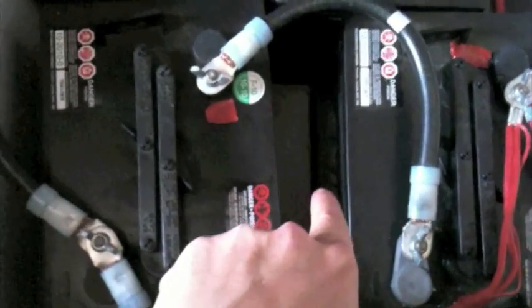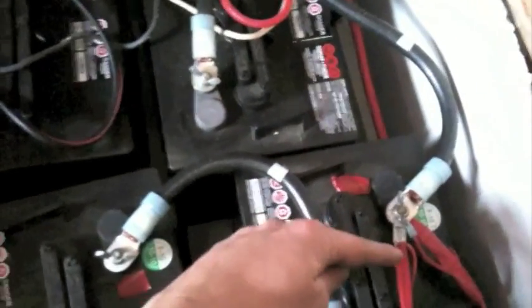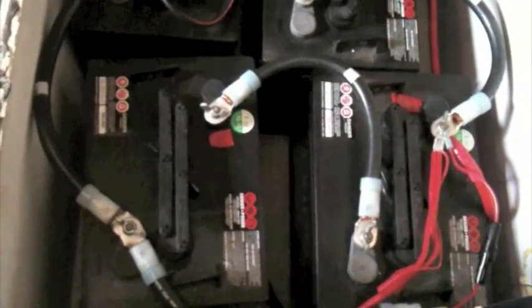Over here is another six-volt and six-volt pair, positive and negative, tied together to create 12 volts. Then I've tied negative-to-negative and positive-to-positive across both pairs, so now in theory I have two 12-volt banks in parallel. The batteries are marketed at 150 amp hours each, but honestly that's just marketing — I rated them at 100 amp hours each when I set up my meter. You're just setting yourself up for disappointment if you go by the advertised rating.